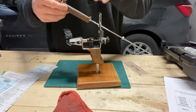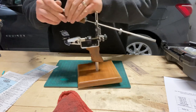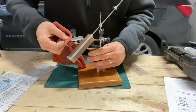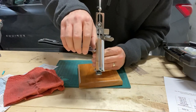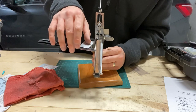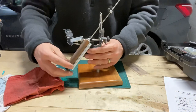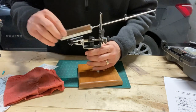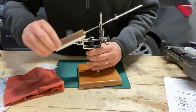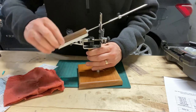Onto the half. I'm not gonna angle compensate that. Or sorry, 1.5 micron. I am gonna wipe this off. Feel sharpness. So yeah, we lost a lot of aggression, but it is super keen. And I'm not looking for an aggressive edge, I'm looking for polished. Well, we'll see how the bite turns out at the end of this.